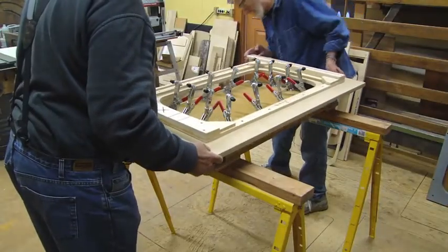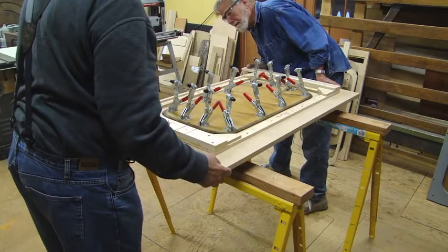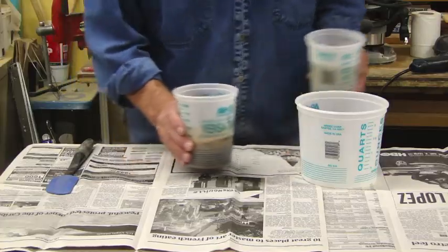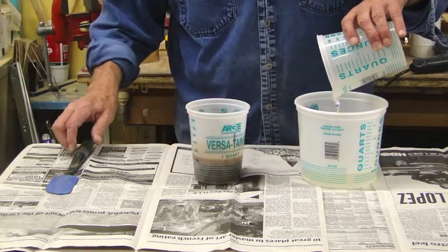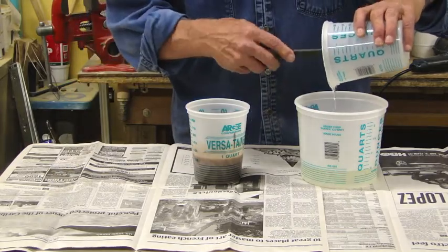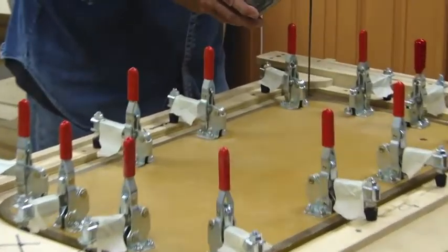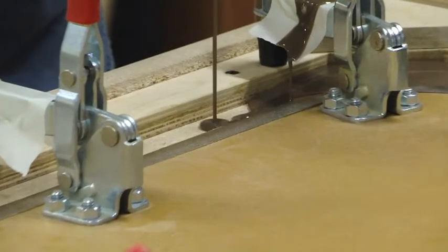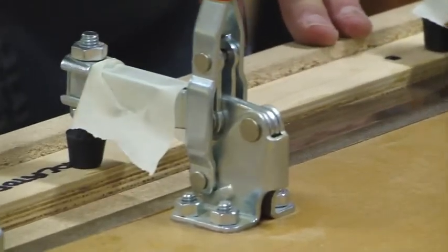They're also inexpensive to manufacture. Now the countertop is installed on the mold dam and everything is clamped down very tightly. The encapsulating resin is mixed by volume for parts A and B with the pigment added to either part. In production, the chemicals will be pre-packed for each countertop. We use gravity casting done at room temperature, with an exothermic reaction curing the resin to the demolding point in about three and a half hours.